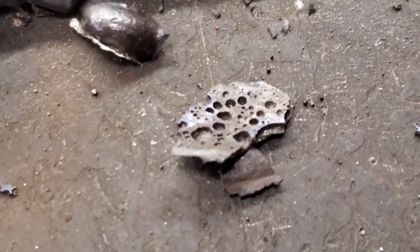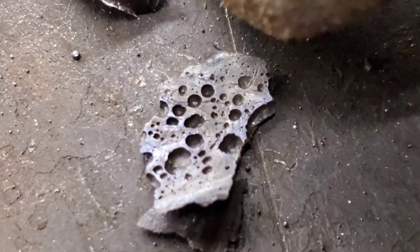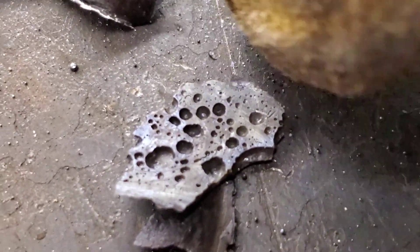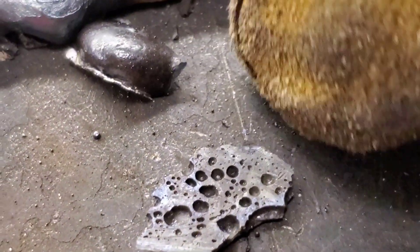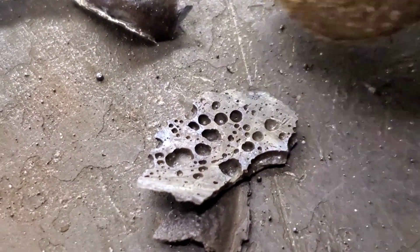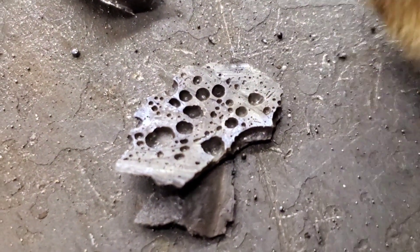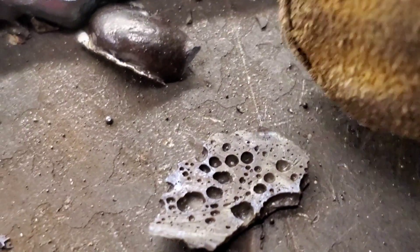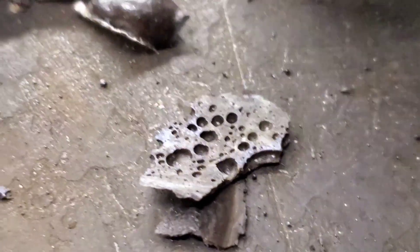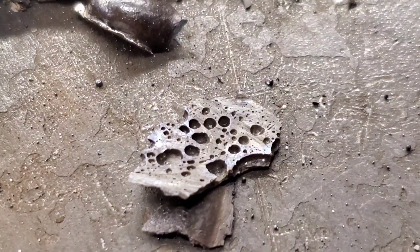Something I just realized after I chipped all this off - look at that slag, look at all these bubbles in there, those atmospheric bubbles. That most likely is because of the water burning off in that slag as we're running that rod. Could also be because of a slight porosity inside that. Just never seen anything like that before in my regular slag coating - it's usually quite smooth and shows the pattern of your bead. But that's interesting how it shows those gas bubbles like that.